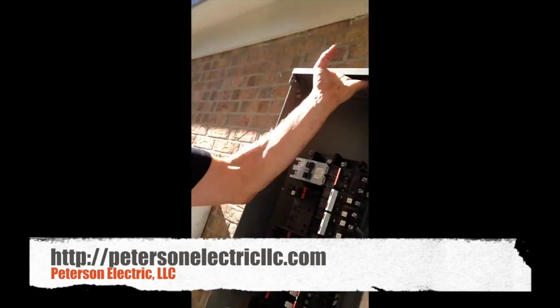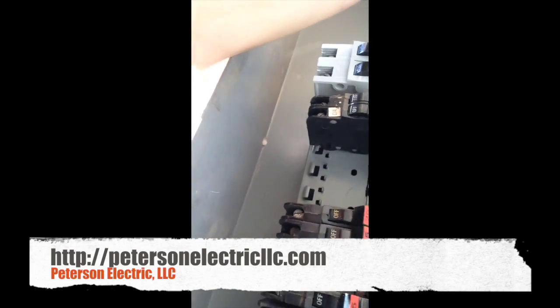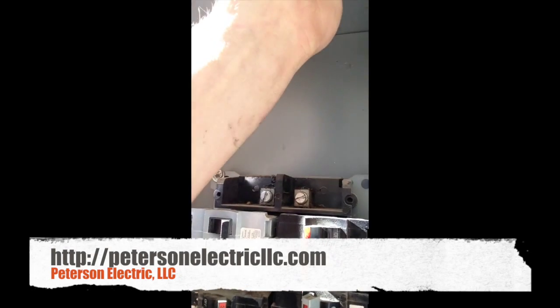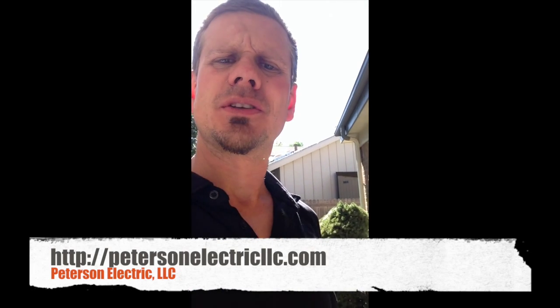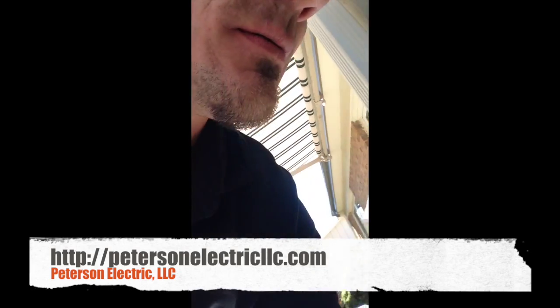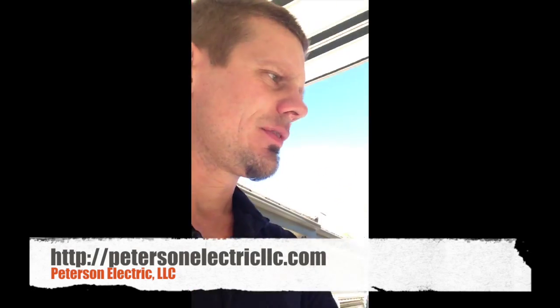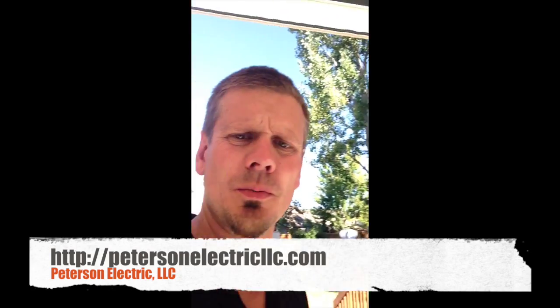What they have here is an old FPE panel. Those are the breakers. When you see those kind of red breakers — sometimes they come in gray and sometimes they're black — but they're FPE. That's when you know that you've got a panel that needs to be changed out. The front cover will also state that it's an FPE as well. Sometimes you can see that just looking at the cover, or even the very front cover that we took off — you can't miss it. FPE stands for Federal Pacific Electric.